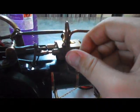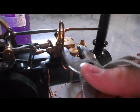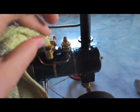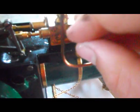Then we work our way towards the other side of the engine, which is where we take the displacement lubricator off. This one's a bit stiff because I haven't really steamed up for a few months, so let's gently take it off with a pair of pliers. Then take any oil found inside the lubricator and replace it. After you've oiled the lubricator, top it up and pop the lubricator top back on.